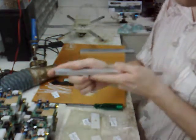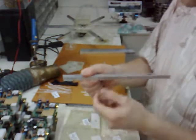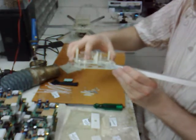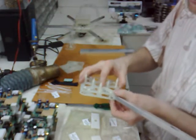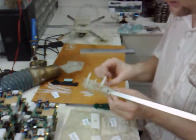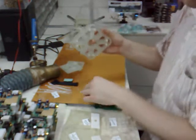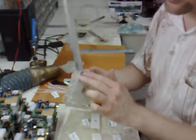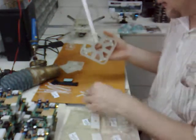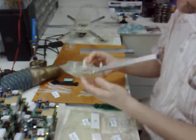This one always has to be on the side. So screw holes up, this one on the side. Let's place it inside the frame like this. Now we can put the metal screw — a 20 millimeter M3 metal screw. The reason why I wanted to place the corner screws first is that now it's much easier because the arm is not moving. Then we can screw that one in like that.